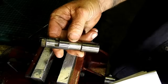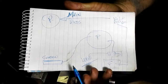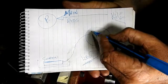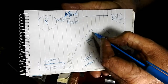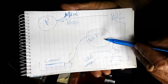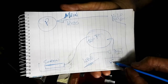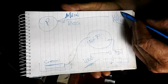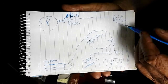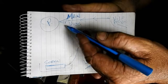What's all the fuss about this filter bypass valve? Let's have a look. This is a thumbnail-dipped-in-tar drawing. The oil from your sump comes through your suction screen, it comes up to the tranny pump - screened only, so it hasn't been filtered at this stage. Then the oil gets pumped by the transmission pump, it comes down past this filter bypass valve to your filter. From your filter it heads off and does your high-low, your PTO, your PTO brake, four-wheel drive, that sort of thing. Then after they've used what they need, any leftover oil heads off to your main pump up the front.